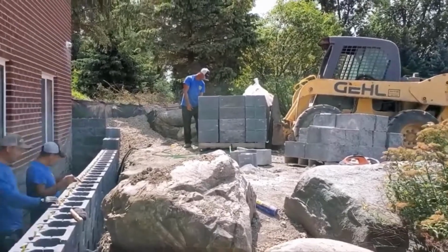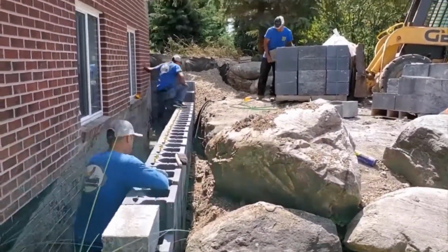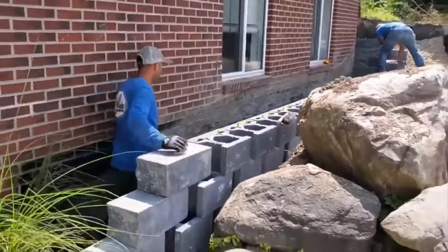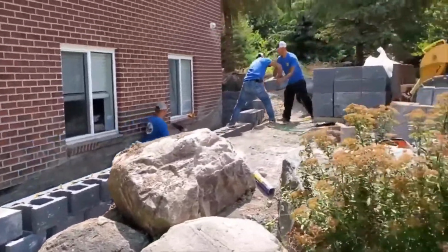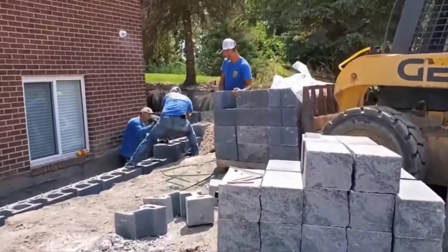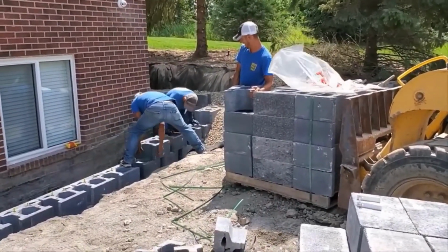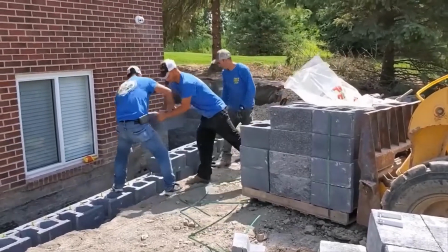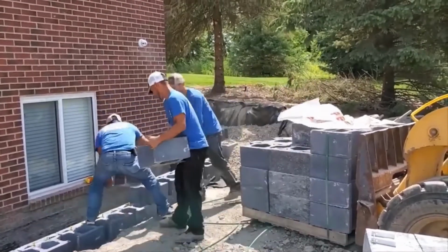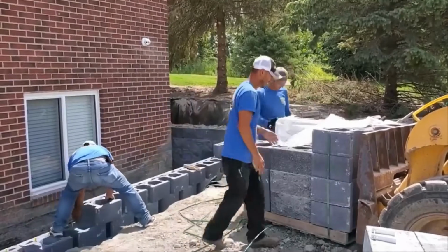And there are daylight windows. The brick veneer in the back of the house was never meant to be built up on. Twenty years ago, a landscaper put dirt up against there because they were trying to elevate the grade around, and it worked. It's just that there's a surcharge, and when the soil's wet with hydrostatic pressures, you don't want to have a failure on that back wall. It doesn't matter if it's aluminum siding, vinyl siding or brick veneer, the construction behind that wall is all the same.